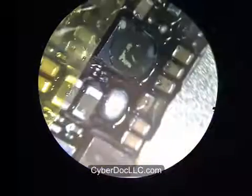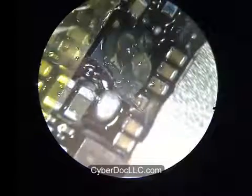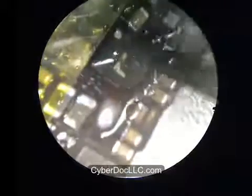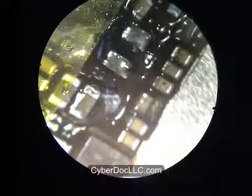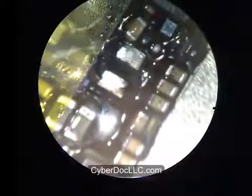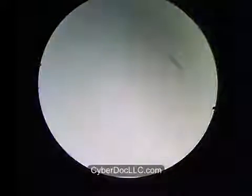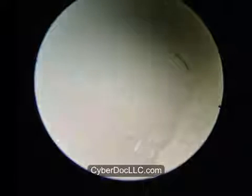Okay, going back to using the soldering iron. So the heat gun method proved too slow, because the heat gun station I was using wasn't high enough in temperature to remove this part. So this is the same old method, using the soldering iron on both sides. And as you can see, the coil comes off quite easily if you supply enough heat. This pad has a pretty large surface area underneath, and the coil is pretty thick, so there was some difficulty using the heat gun earlier for deeper penetration of the heat.